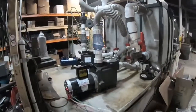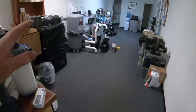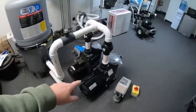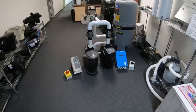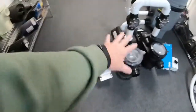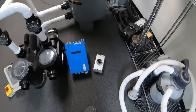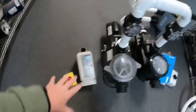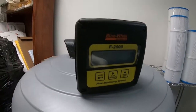So how would you plumb this in? I've seen it work now — I believe you. Let me go ahead and show you. Here in the showroom you'll see I have a cartridge filter and our DC and AC pool pumps. You'll see how I have it plumbed in: two check valves on the returns of the pumps. This is our AC pump — we have our drive controller and our disconnect for AC. Then we have our DC pump with its controller and DC disconnect. Everything is controlled on the AC side by the flow meter.